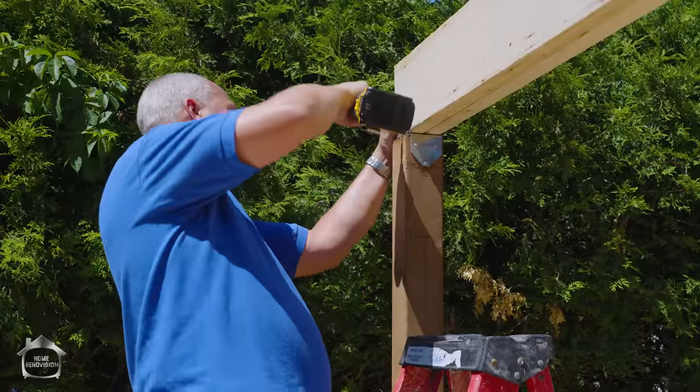I want to give a warning here — don't use what you see here as a homemade solution to removing a structural load-bearing wall and sticking this in place. This is not what it is. This is just the snow load of a small shed roof that has no building code. So this is more than enough for our liability scenario, but don't go thinking a couple of deck screws every couple feet is good to go. Nope — you'll get someone killed.